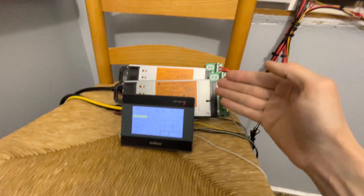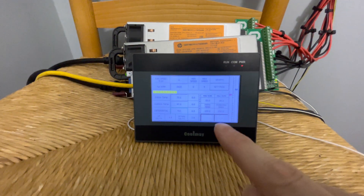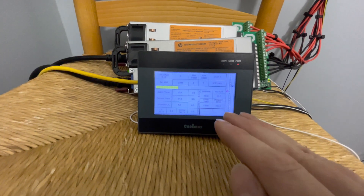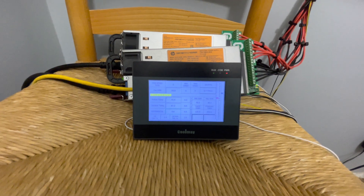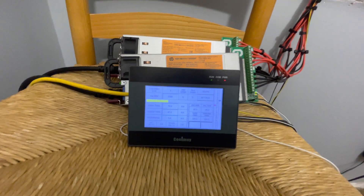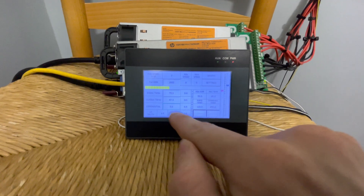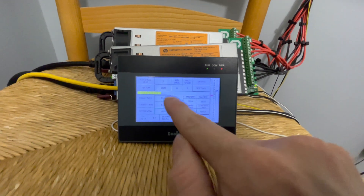There's a temperature sensor just hanging there. I have dual HP common slot power supplies — 750 watt versions — and a custom PLC-driven controller running them. I'll do a video more on this because it's pretty detailed, but it's a differential cooler. I couldn't find anything that would do this. The whole purpose is to minimize fan speed, so the fans run as slow as they can to save power and reduce airflow through the filters and the building, and also ensure that on cold days you don't over-cool and hopefully minimize indoor humidity. As long as you always have a differential, the indoor humidity will be lower than outside, which hopefully means drying can occur. The controller will target this differential primarily, and as long as the differential is satisfied and it's within the min and max temps, it's good. But if the differential is exceeded, it'll continue to increase fan speed until the differential is met. And if the indoor temperature goes below the minimum, it'll ignore the differential and keep dropping the fan speed.